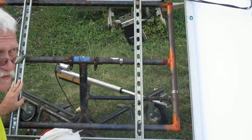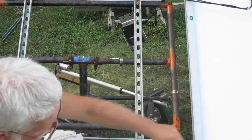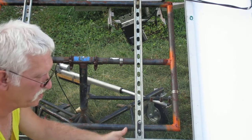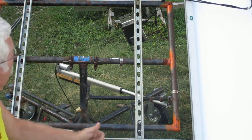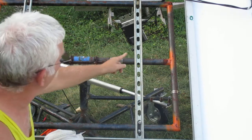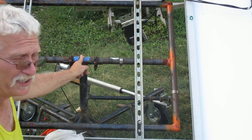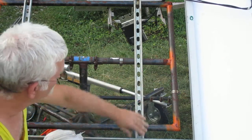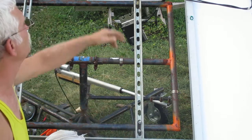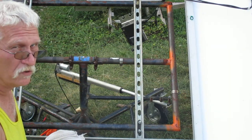Both vertical pieces are 45 inches long. To determine the spacing, you measure the width of the solar panel — in this case it's 32 inches wide. You subtract 6 inches and divide by two, which comes out to 13 inches. Find the center of your rotation assembly, then measure 13 inches out to the outside on each side. Always go from a centerline so everything stays square — that's where you mount these. Center the piece with the rotation assembly both vertically and horizontally.